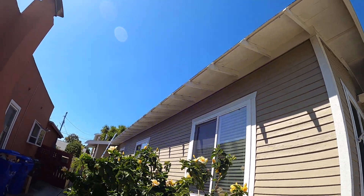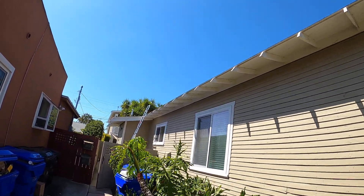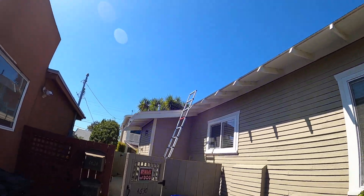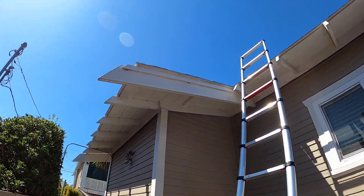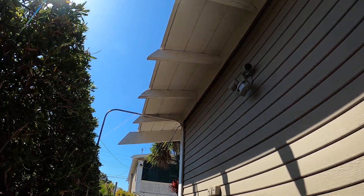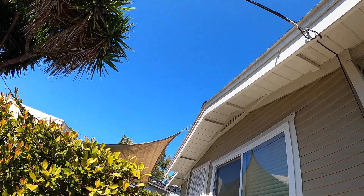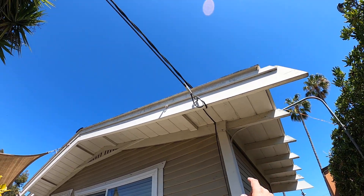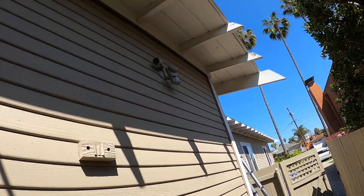This tells me this is an old roof. After walking around, there is some minor damage to some of the eaves that will have to be looked at. That's just one layer of asphalt shingle. Walking around a little more, you'll see there's one more piece of fascia, but that's just about it — those two pieces. The rest of the house has got no fascia.